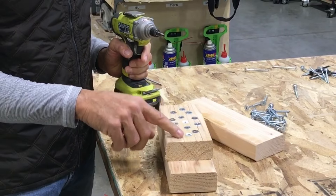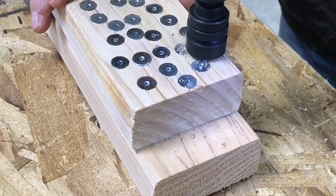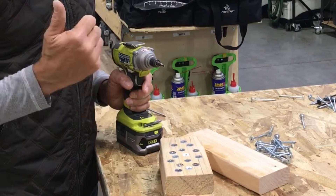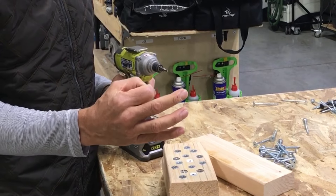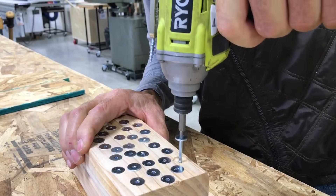If you want it flush, you need to pilot the hole flush because the Torx hangs on so well, it doesn't pop out like a square drive bit would. So something's gonna break — either you're gonna pull into the wood, which most of the time the wood's too hard to pull a big washer head into, or you're gonna snap off something, or you have to set it flush.